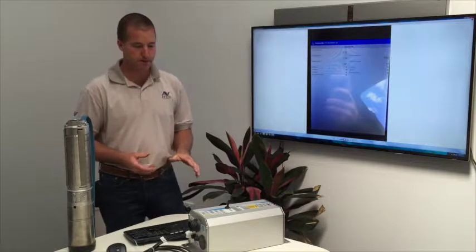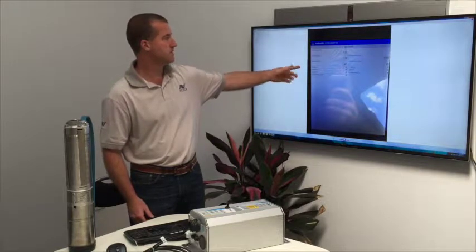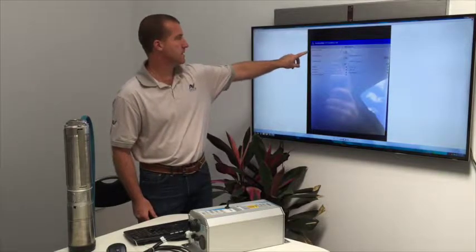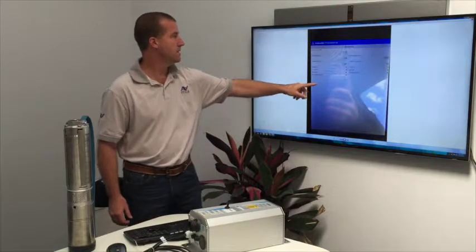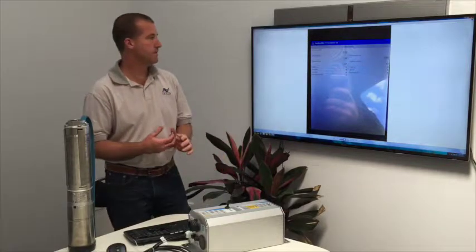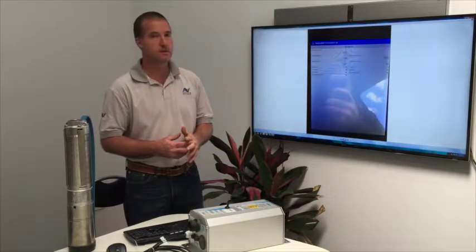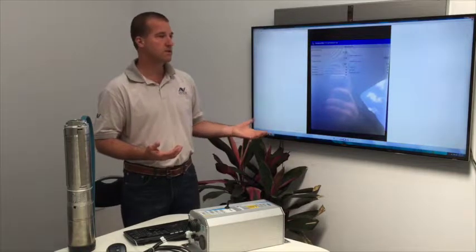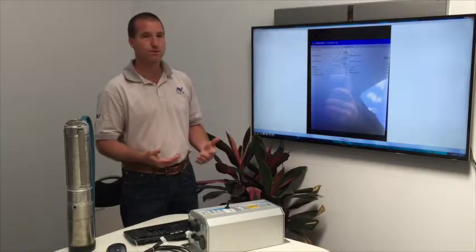Another clever thing about this pump is that you can actually see what happened. So you can log on through your smart device. In this case it's a Samsung Galaxy, I believe, and it tells you how much power is coming from the panels, what the voltage is of the solar array, how fast the motor is turning, and the temperature of the controller. You see that it's on at the moment and pumping water. So we can see how much water was shifted per day. In this case the system was designed to pump about 5,000 litres of water per day on the worst day of the year, or the driest day of the year, which in this case the driest part of the year is actually around April because of the way winter and spring and autumn work in this area.